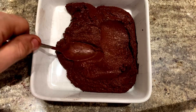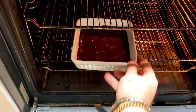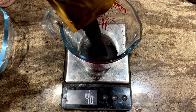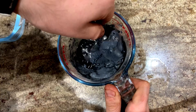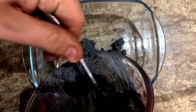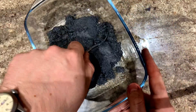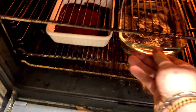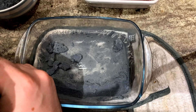We bake this mixture at 120°C in an oven for 90 minutes to remove the water. This causes the expanded starch chains to compress back down around the regolith and around each other, forming quite a strong bind. As you can see, this baked compound is already pretty hard before we've even done any compression.